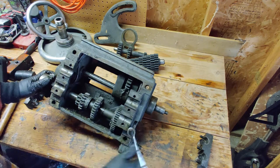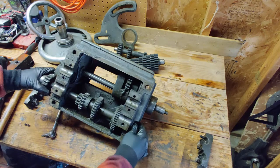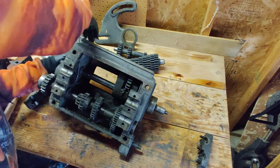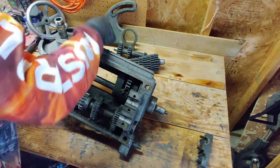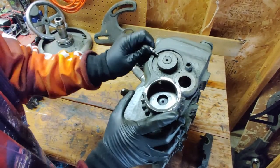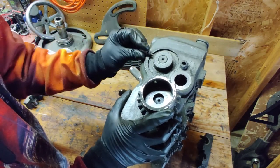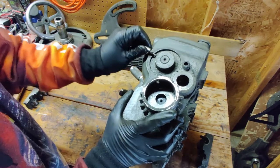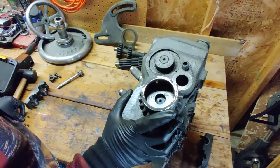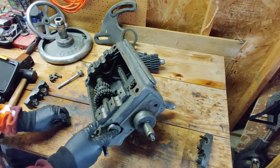One of them was missing. I don't know if that's from a previous repair or if it was designed to only have two, but I doubt that. We've got another of the same thing up here — looks like they're already loose. Up here we've got another collar there. Eighth-inch set screws out. So I guess that means the shaft should be moving out the other direction, since this is the side I've got that collar on. Let's see if we can get this bottom one to budge first.